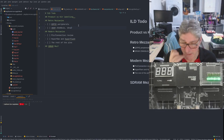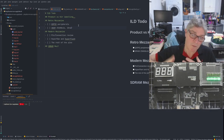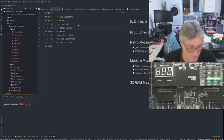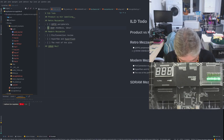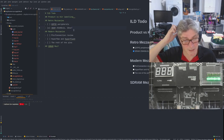So a 10 nanosecond part will give us 100 megahertz 16-bit access, or 200 megabytes per second, without all the nasty interruptions that you get with things like SDRAM, or the complexity of the state machines involved in that, or similar with the even more complex HyperRAM. So that is the amount I was looking at, and I think we came to the conclusion that that was probably the best way of going in the conversations. There was a sacrifice there in that we needed the UART pins,